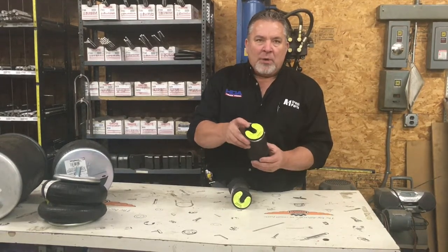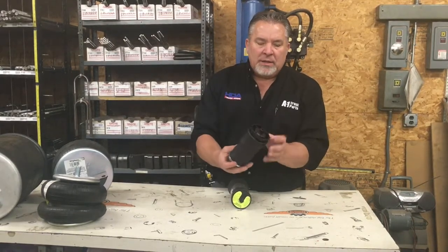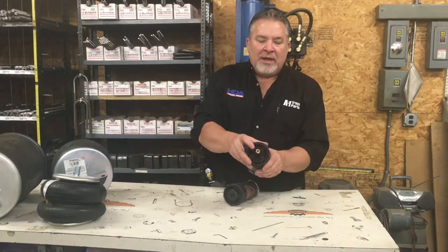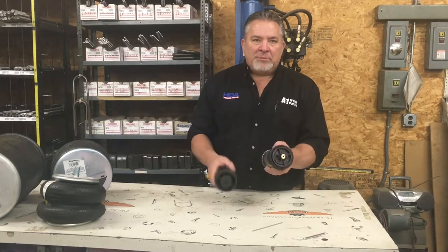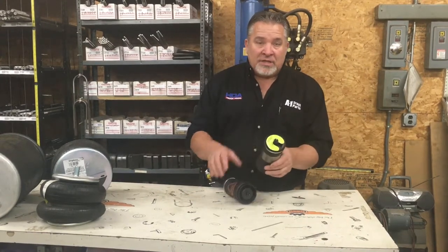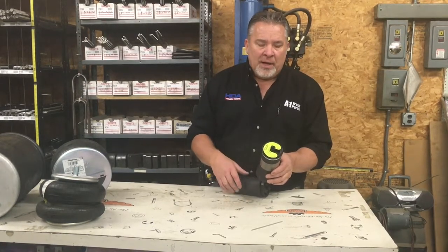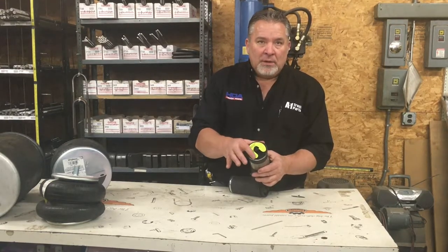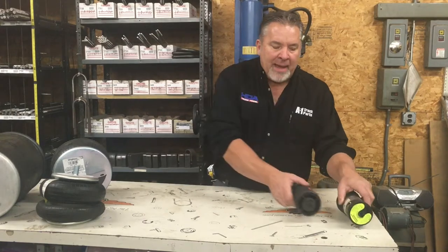But there's a lot of difference in mounting. There's little small pins, little air stud mountings, little push lock fittings in the end. There are a lot of different bags, but if you can get us the make, model, and year of the truck that would be very helpful, or the last digits of your VIN so we can call the manufacturer and try to help you out, and or the tag on the top of the airbag would be very helpful. That's on a cab bag.